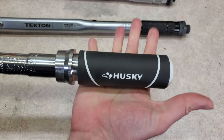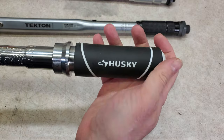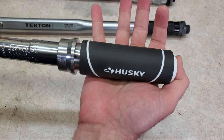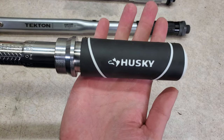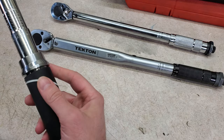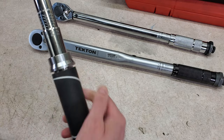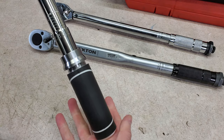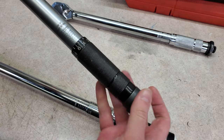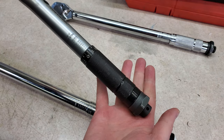The Husky has a comfort grip — some people don't like these because they can get all cut up and greasy, but I don't think that's as much of a problem on a torque wrench compared to a ratchet or screwdriver. The black parts are rubberized overmolding and the white parts are hard plastic. Another feature I like is this locking collar. To adjust it, you pull down the collar, twist the handle, then let the collar up when you're on the setting you need, and it's locked in place. That's easier to use than the other two, which use a threaded nut — you adjust the handle to the setting you want, then tighten down the nut to lock it in place.